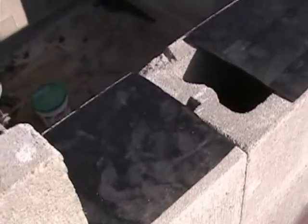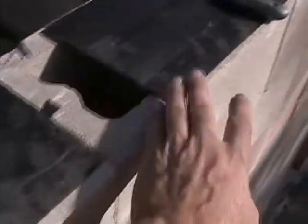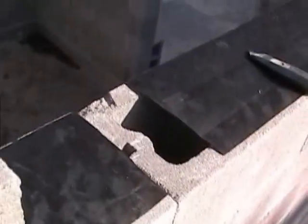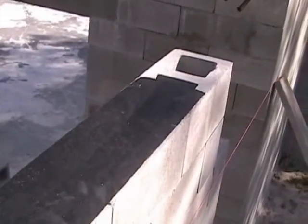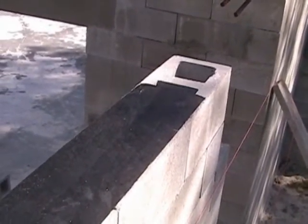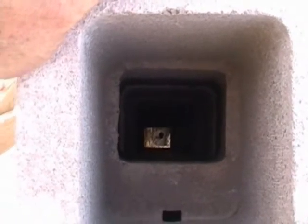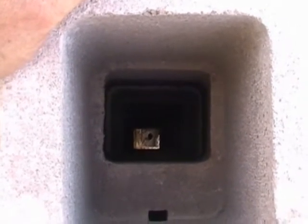This roofing felt cut into strips is a concrete stopper — it keeps the bonding concrete from falling down through the rest of the wall. Notice it stops on a block joint. If you had a joint in the middle of a cell, it would push down the two ends of the joining material and blow out the concrete right through the hole — this is unacceptable. Instead, you bring the next piece of felt up to the block joint so that you have solid felt over all the cells. Looking down the wall cell hole, notice how the blocks are misaligned and how the half blocks have thicker sides on one side — the concrete just fills this void and makes everything very strong.